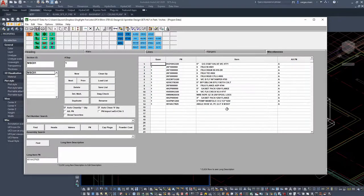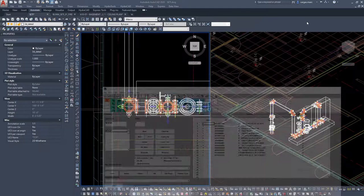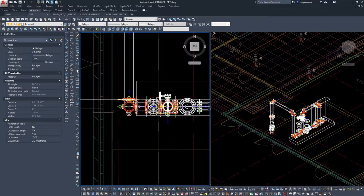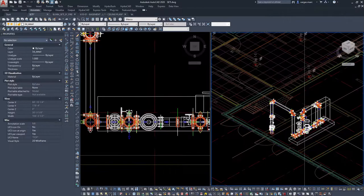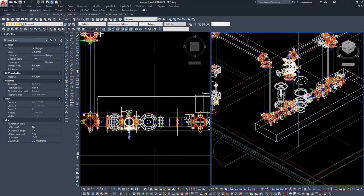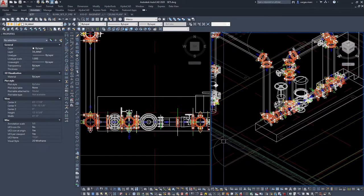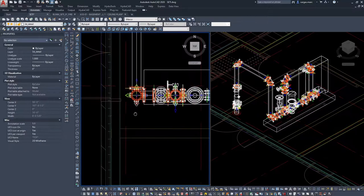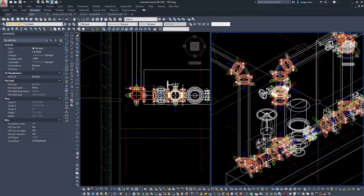And with HydraList, you only need to select it once to add it to your library. And then once it's in your drawing, you can add it as many times as you need. So what we're going to do here is probably come off here with a 6-inch 90, drop down, 90 over, and then out the wall this way. And we'll see if we got enough room. So first things first, let's put our 90 in there.